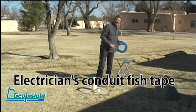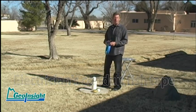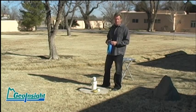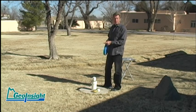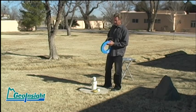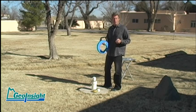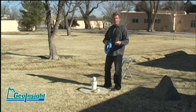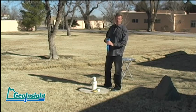What we use is called conduit fishing tape, or fishing tool, and it's used to run electrical lines through conduits in houses and buildings. What it consists of is a flexible steel tape — in this case stainless steel — on a reel, and it's about 120 feet long, this particular reel. These are readily available at about any hardware store or through electrical supply shops and relatively inexpensive. This one happens to be made of stainless steel but it wouldn't have to be; carbon steel will work fine.